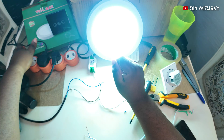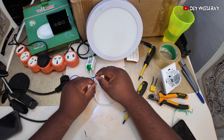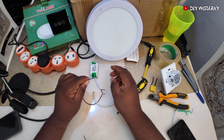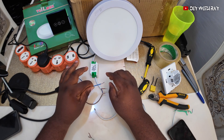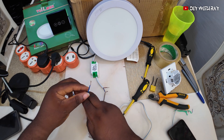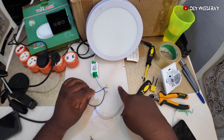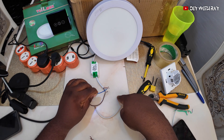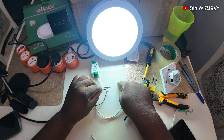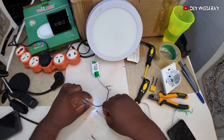So how does a switch operate? For a switch to operate, you have to break either the live or the neutral — whichever it is, you have to cut it off, and the circuit is now open. This is called an open circuit because it's not completed. Once you close your switch — when you press it on — you have closed the circuit and the light comes on. When you open it, the circuit opens and the light goes off. That's basically how a switch operates.